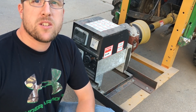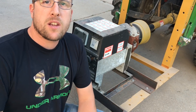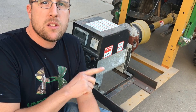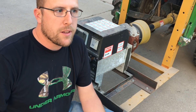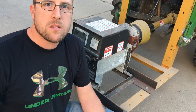This is a 15,000 watt generator. It will actually run off of a 50-amp interconnect to my main breaker panel in the house. Now the barn is on its own meter, so it will not run off of this generator unless I were to hook it up dedicated to there. But what I found is that when you have a power outage, I'm not really going to be working in the shop anyway, and if I am I can switch power from the house to the barn.